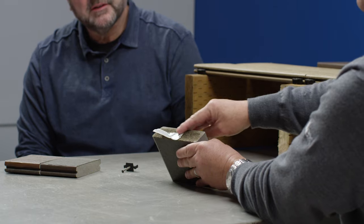They're all cut with a traveling saw coming down off the extruder — the product is extruded out and a saw follows it and cuts it while it's moving. Earlier generations weren't very accurate or square, so a 20-foot board might actually be 20 feet 2 or 3 inches. Today we're maybe 20 feet and a half inch to one inch — it's gotten a lot more accurate. But you still want to cut that end to square it up. Also, you can see how rough the manufactured end is compared to the cut end, which is much smoother — it's night and day.